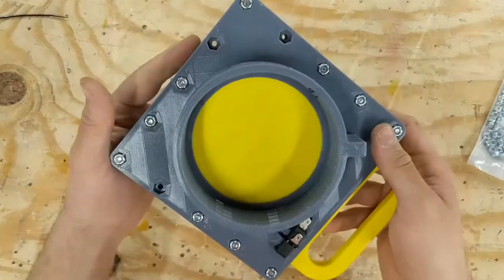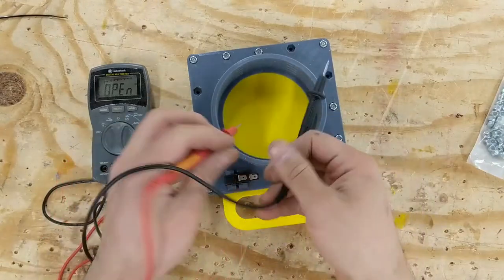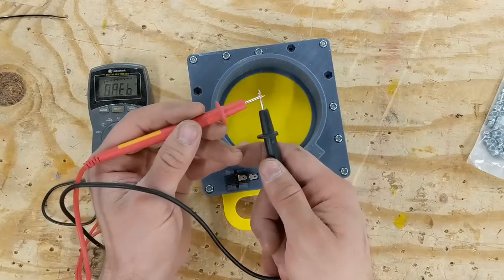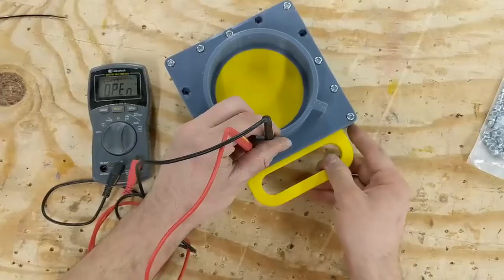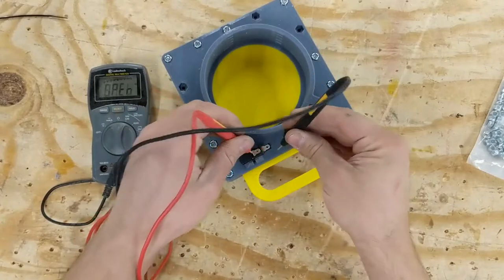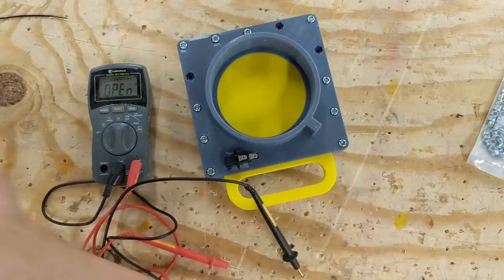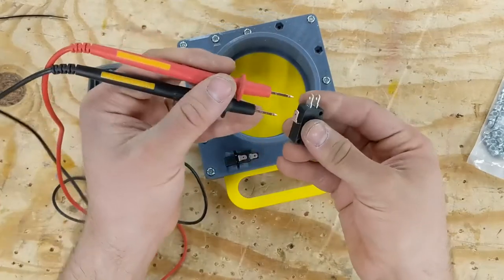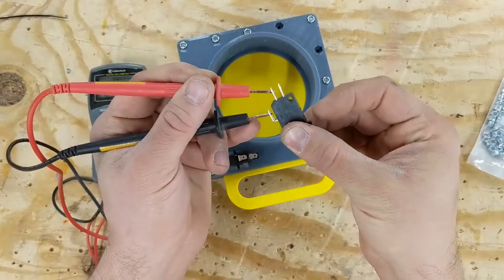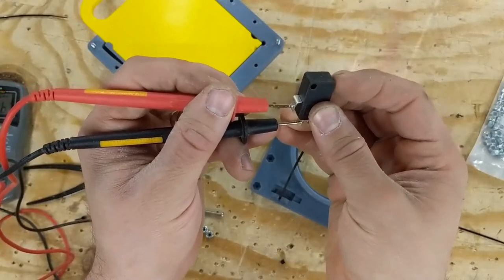So that's my blast gate fully assembled — well, mostly assembled. Just to illustrate the action the switch is doing for me, I've got my multimeter here in conductivity mode. I'll hold those across these two pins. I put a dud in here. Here's another one out of the package. Good thing it's easy to take apart. This new switch works — this footage confirms it. I'm testing at every stage because I've become paranoid.